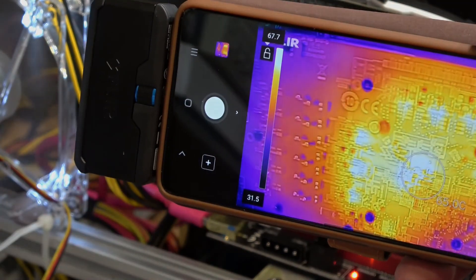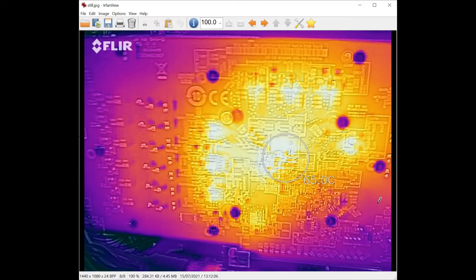There is a bit of thermal mass between the processor and the sensor because there's a circuit board there. I'm going to take a photograph. It's pretty reasonable — we can clearly see the processor and the 65°C region. It would be a little bit higher but I'm not quite in the middle of the processor. We can also see a screw hole in the board, but the cool spot is showing just slightly offset — only about two or three millimeters. We can see the same with the capacitors — slightly cool spots on the background board, slightly misaligned with their thermal image.